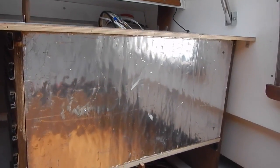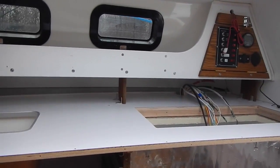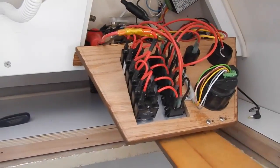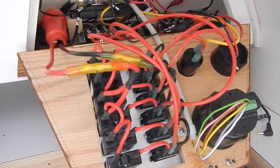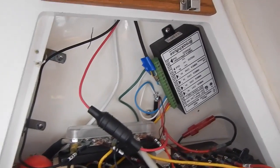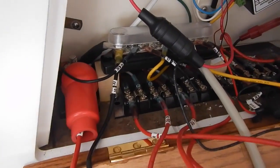With the ice chest carcass and countertop now fully attached to the boat in their final positions, we've brought the upper shelf unit back into the boat, which means we can start making electrical connections. I believe I have made all of the electrical connections here at the breaker panel area, and also connections for the NMEA multiplexer, which will also talk Wi-Fi to my iPad. I did most of this work with the whole shelf unit pulled out a few inches, which made it much easier to make the various connections.